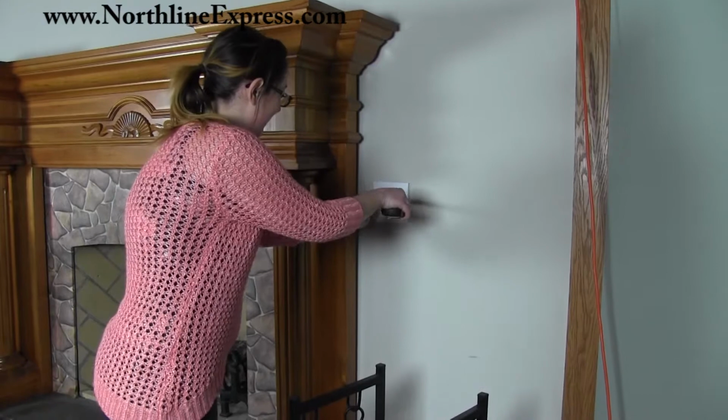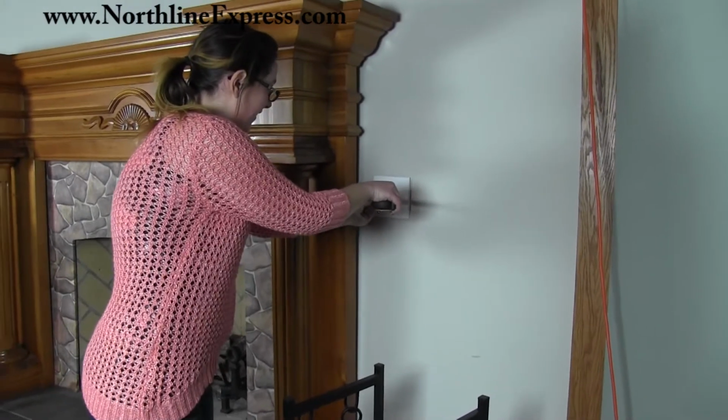It's time to gather some side distances. Let's do this by measuring the edge of the hearth or surround to the nearest light fixture, window, corner, or door on each side of your fireplace. Now here are the measurements you're going to need if you're installing a new fireplace mantle. Remember, these guidelines are assuming that you have a fireplace facing and a hearth. If you don't have a fireplace facing or a hearth, simply skip those measurements.